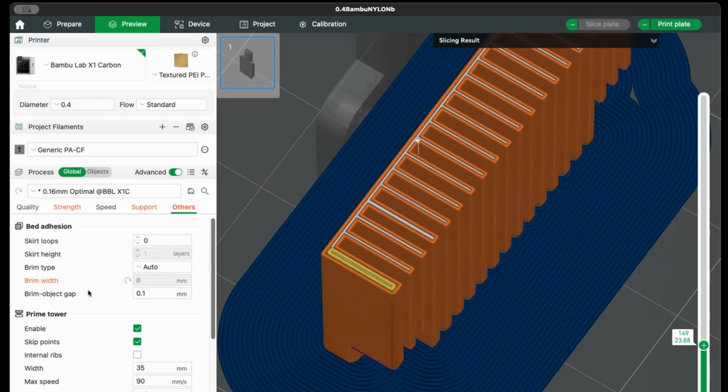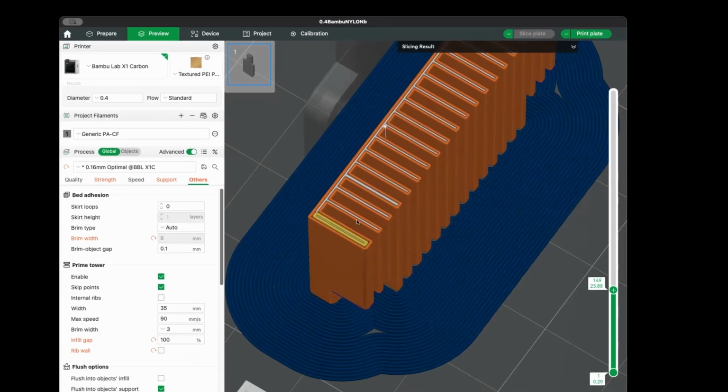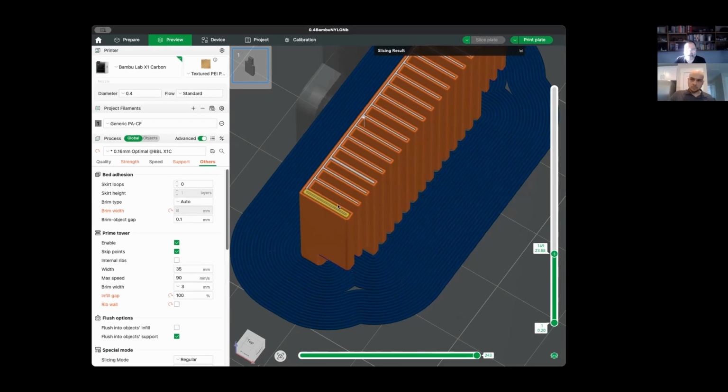If you can eliminate that, yeah. I think maybe I'll do another YouTube segment where I do a deep dive into reconfiguring these settings to get rid of that gap fill and do 100% perimeter, but I'll leave that for after the segment. But that's great advice because it makes a lot of sense. You naturally want more of that heat extraction, and using that perimeter instead of that gap fill is definitely going to result in that. So that makes sense.